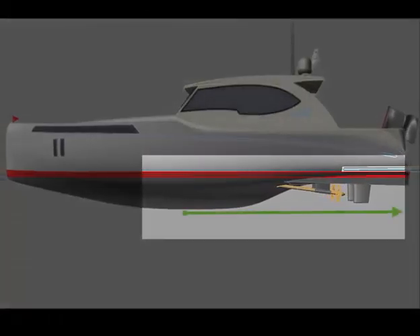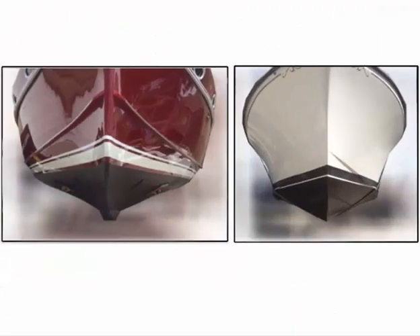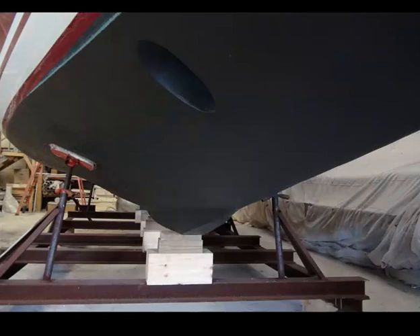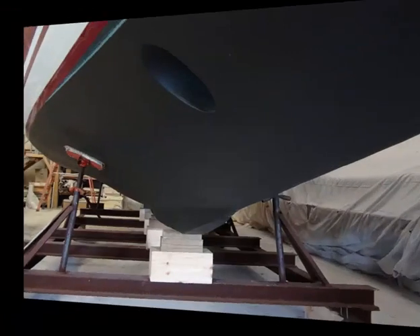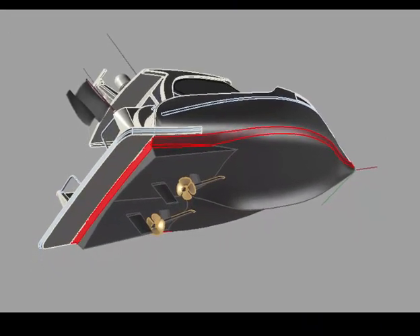The hollow and the concave aft sections also tucked the propellers and rudders up above the keel, which is great in shallow waters or grounding situations. Finally, I used the sailboat trick and made the bow entry sections with a slight hollow, which totally stops that pounding or head-jerking motion that beats people up terribly. There's never been a hull like the SRD — that's how I received the patent.